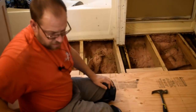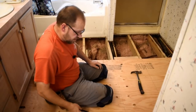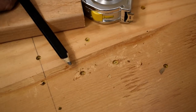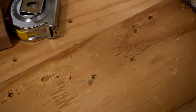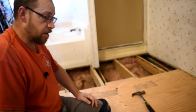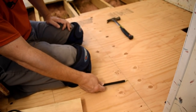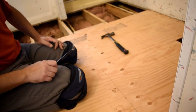So something I wanted to point out just real quick. A person might think I really drove that screw because it almost goes through the board. That's not a good idea. If you'll notice right here, you can see my screws. This one right here got too deep, so I put another one right here beside it so it would still have some strength. What happens if you shoot your screw almost all the way through your plywood? You don't hardly have any strength because it's just holding on the bottom layer or maybe two layers of the plywood. This is a 5-ply plywood we're using here, so you definitely have to countersink them, but at the same time you just want to countersink them. You don't want to go real deep in the wood or else it loses strength. Just enough to get them below the surface is what you're wanting. So I just wanted to point that out real fast.